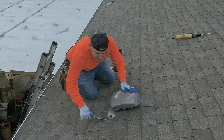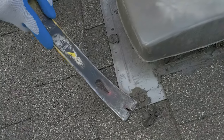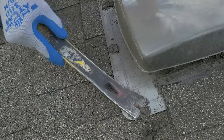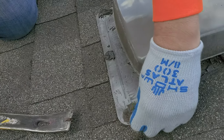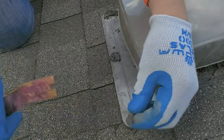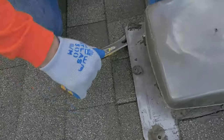There are three nails right here on the bottom of it. And if you see tar right here, you kind of want to break it and check it out. There's a nail right there — we're going to take up this nail. It looks like they put it on with a rubber grommet on it. See? That's gone though. We're going to take that off and take off this one right here.